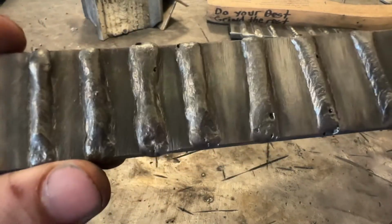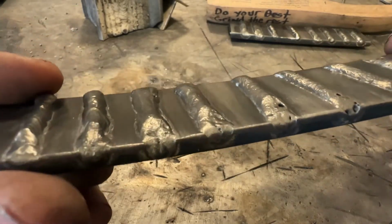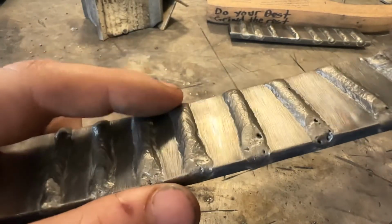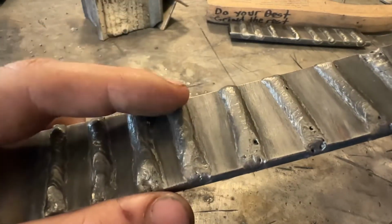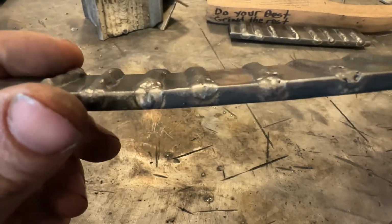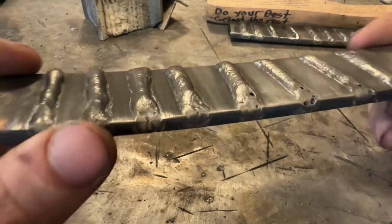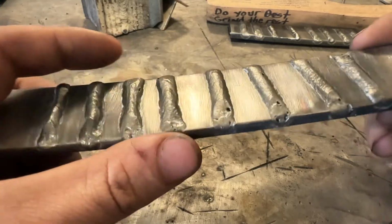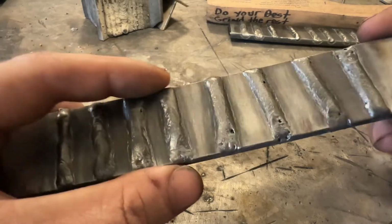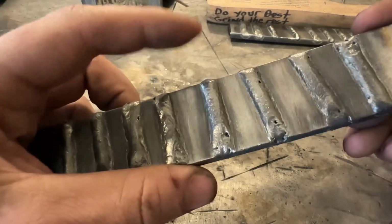Based on what I see, I would say that it's acceptable in profile. The weld size is pretty decent. Seems to be run a little bit on the hot side, but it is just a bead on plate, so that's not too unexpected. If we're actually doing a weld joint, I think this would turn out pretty good. I would say that that's overall acceptable. If you see something like this, for doing actual fillet welds, lap welds, that's pretty acceptable. If we could change anything, like I said, maybe slightly less, 1/2 volt or 5 amps might help to drop the amperage. This guy, what do we see?